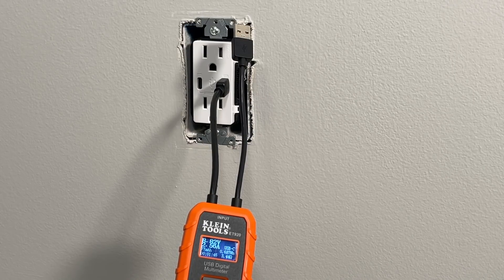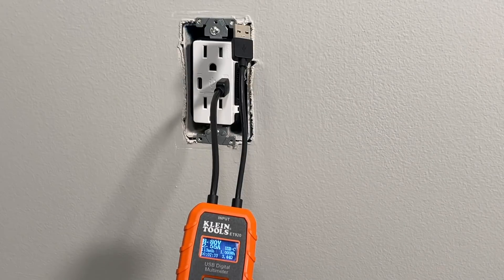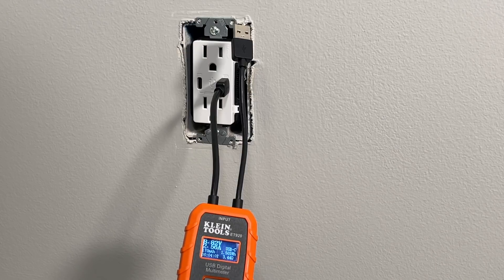Speeding through the trial, I'm tracking how many watt hours accumulate. Checking temperature, the highest I got on the side housing was 77–78 degrees Fahrenheit — nothing to be concerned about. I'll run this through five minutes and then convert watt hours to the estimated time to charge from 0% to 50% on this iPhone 12.